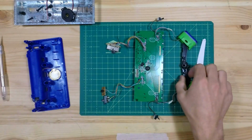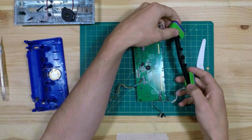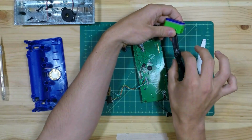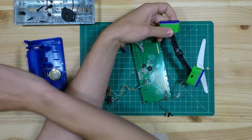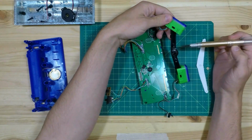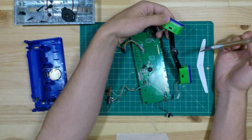I had to take everything out to get at the I-beam here. The button beam did have an I-shaped cross section. However, it did not get thicker as it went towards the center. But it did end up breaking right here, which is the point farthest away from the button load, where the stress in the beam was the highest.